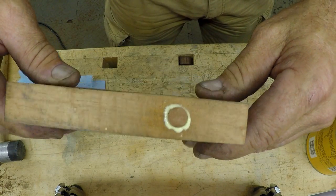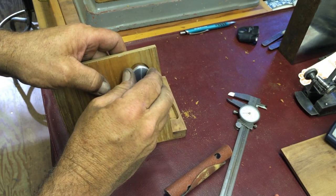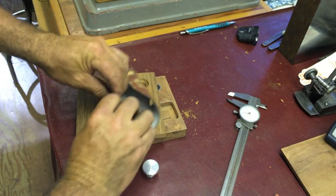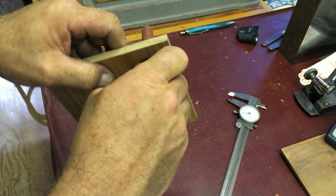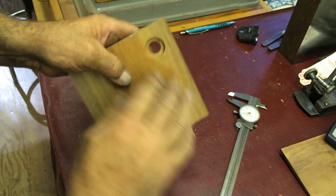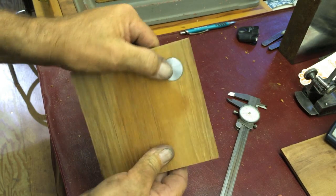Here's a close-up — I've already glued in the hinge pieces with epoxy on the bottom. Now I just need to do a little sanding on the holes because it's a little bit snug. I'm rolling up a piece of sandpaper off the orbital sander and spinning it around a little bit — that keeps your hole pretty round. It just needed a little bit and it went right in.